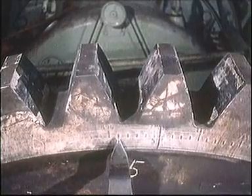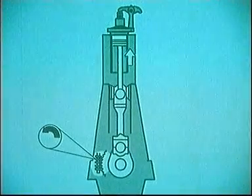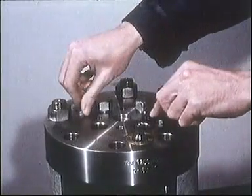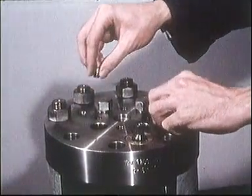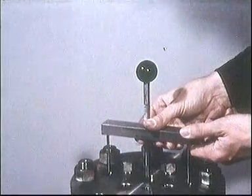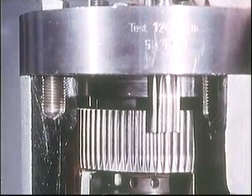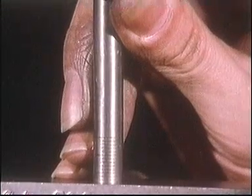The engine piston is turned to top dead center and the two small plug screws on top of the pump are removed. Insert the legs of the measuring tool in the two holes. The legs land on top of the pinion nut in the top cover. Press the measuring pin home in the center hole of the plunger and secure it with the thumb screw.